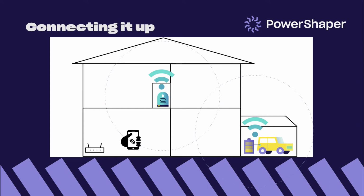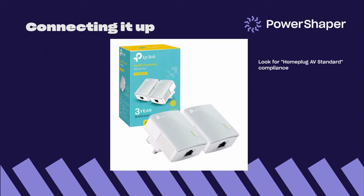So once you've found a sweet spot, set up your HEMS there. If it's a long way away from your router, then you can save having Ethernet cables trailing throughout your house by using a powerline adapter such as this one. Other powerline adapters are of course available. Now this sends Ethernet over your domestic mains, so you effectively have an Ethernet connection on every plug power socket in your house.